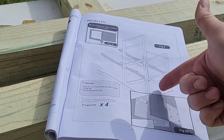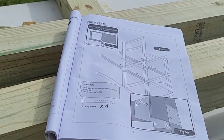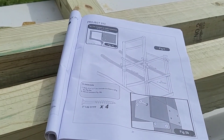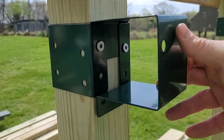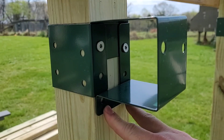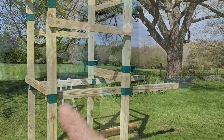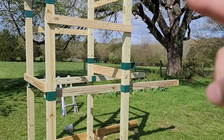Now on to figure five. Our structure is set up and we're going to install the eight-foot four-by-fours outlined in the manual. You'll also need some lag screws from the system to hold them in place. This is definitely a team lift — can't do it by yourself. We stick the four-by-four through the connectors, which aren't fully screwed in yet so they're flexible. Once in, we screw down here and through the sides, putting two on the bottom and two on the top. Now we can see the two four-by-four posts sticking out, and it's time to get frame three and install it on the end.